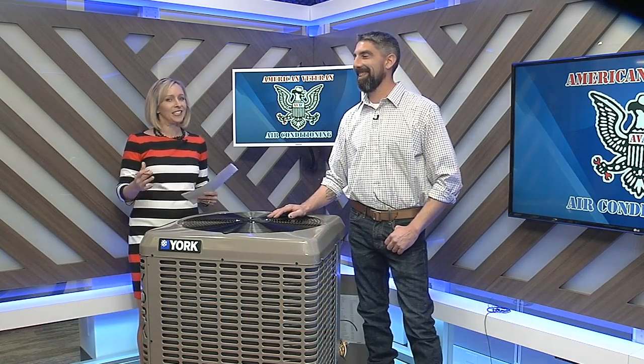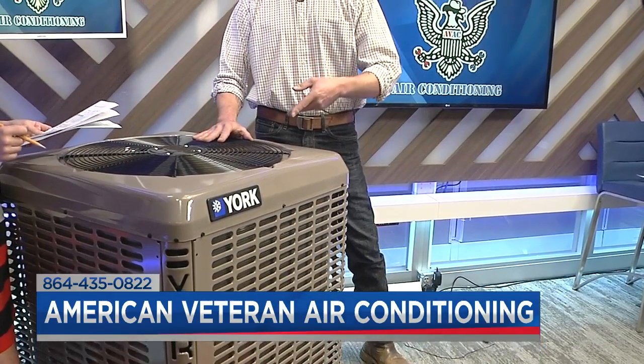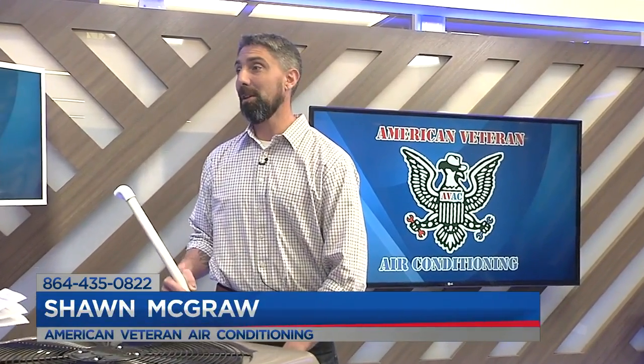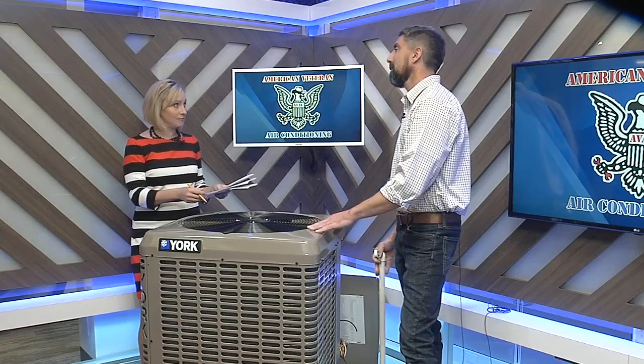What is the first thing on the spring cleaning checklist? This is the time of year people start putting bark out in their yard, really trying to make their yard beautiful. One important thing is maintaining clearance around your AC unit — at least two feet away for proper airflow. Also, that bark put up against your house can cover the drain hole coming off your AC unit, plugging it so it can't drain. That backs up into your house and starts flowing into your ceiling, so we want to check the AC's drainage hole and make sure it's not blocked.